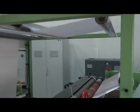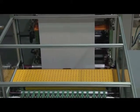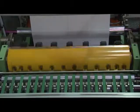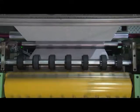After ruling or flexo printing, the paper from the printing tower passes through the rotary drum type cutting system. The cross-cutting unit is provided with one flying and one fixed knife rotary cross-cutting system to cut sheet length in variation of 5mm. The change of each sheet size is controlled by timing pulley.